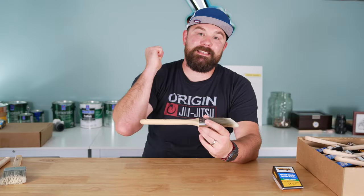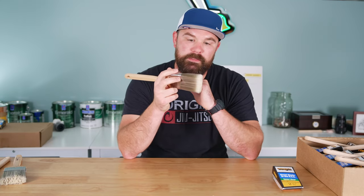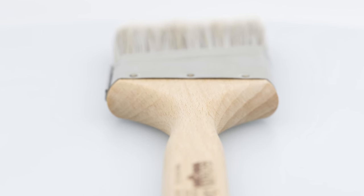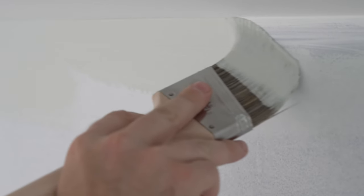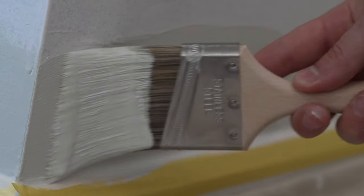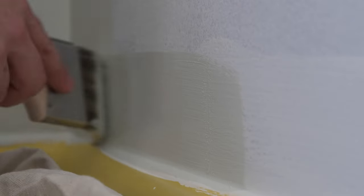Coming in at number three is handling — basically how this brush feels in your hand, but also how quickly it can cut in and do all the things you need a brush to do. The shape of this handle is really nice compared to a lot of other brushes that have some weird cuts, at least to me. The chiseled toe of the bristles is really conducive to cutting incredibly clean lines, though a lot of that comes down to how skilled you are with a brush. Part of that accuracy is also the sash — this angle — and that's why I like it, because I can get into tighter spots than I can with the squared-off brush. Nothing against squared-off brushes; I know a lot of old timers like squared-off brushes and they have a lot of good uses, which I will cover in another video.